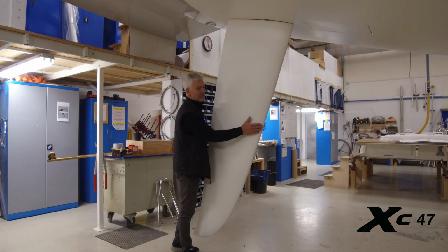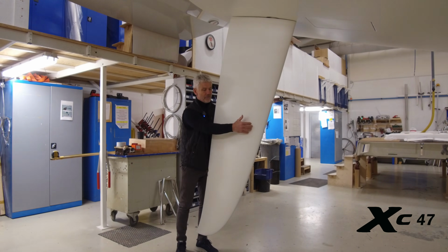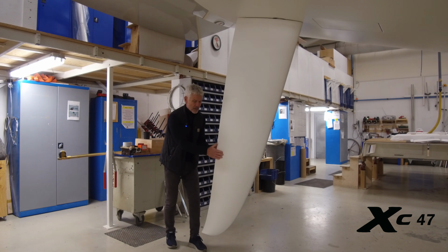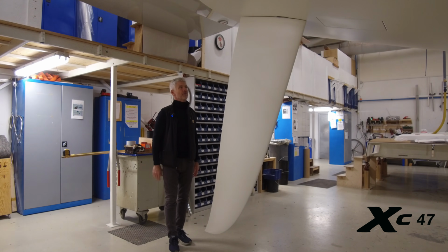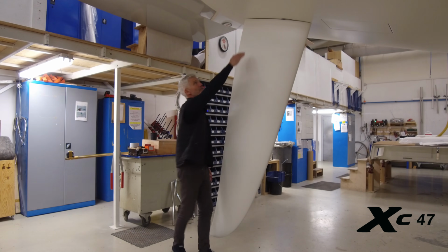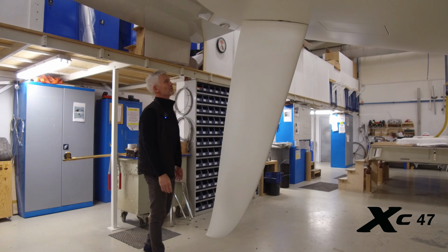The designers have cared so much about the radius of the entry, how far back to place the widest point, a double concave of the aft section, a swept back tip of the rudder, as well as, of course, the rake of the rudder. Look how smoothly it fits to the hull, allowing no turbulence.